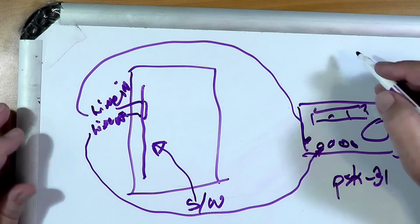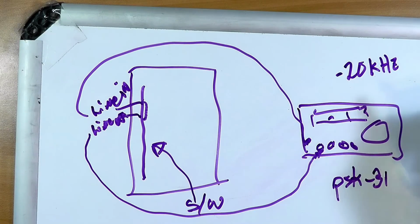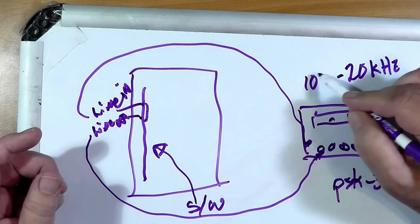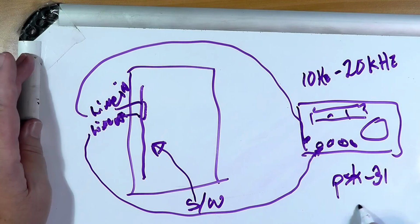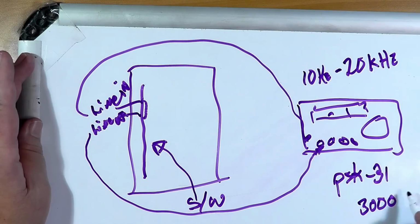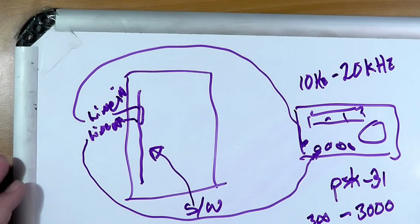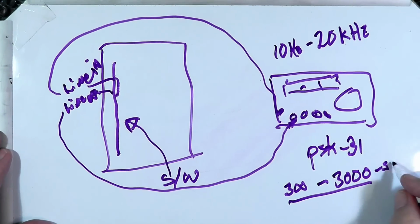and it would create the appropriate tones to be transmitted. Now, there's something interesting to note, of course. Quality sound cards will go up to 20 kilohertz or so audio, which is way above what I can hear. At my age, I can hear up to about 8K. And they'd go way down, 10 hertz or something like that, for reasons of very high fidelity. And the thing is, though, on amateur radio, the highest frequency of interest is 3 kilohertz, and usually starts around 300 hertz. The sound card modes were made to use this because this is the equivalent of an SSB channel.